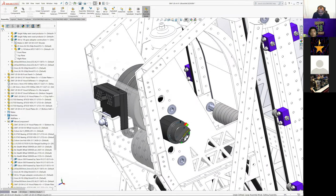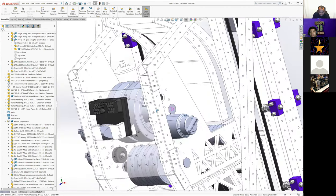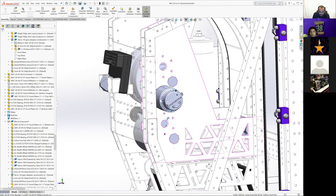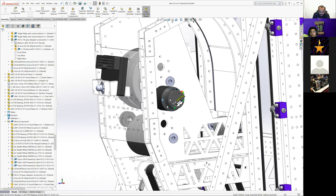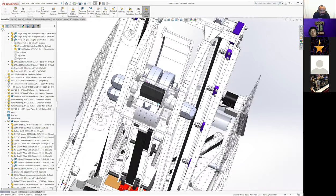I think these were actual shoulder bolts, right? I don't think we did the quarter 20 things up here. No, that's a lot of RPM for that. Yeah. Shoulder bolts and Loctite to make sure those aren't coming out. Anywhere where we have these blind threaded holes and we don't have lock nuts, we get some version of Loctite or Vibratite or whatever you want to use on there. Some form of thread locker.